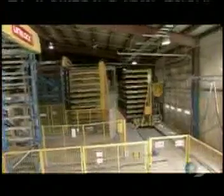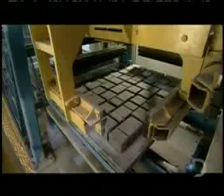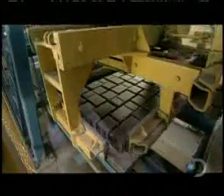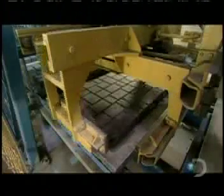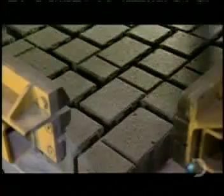They are now 70% cured as a result of the chemical process that binds the cement, sand, and gravel, causing the pavers to harden. The rest of the curing will happen over the next 28 days. The pavers are now sturdy enough to handle, so 4 steel arms with rubber pads move in and straighten the stones on the board. These alignment arms are hydraulically driven. They arrange the concrete pavers so they interlock snugly.